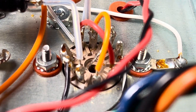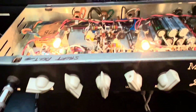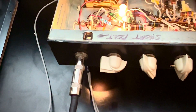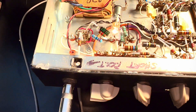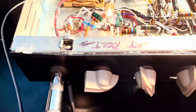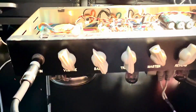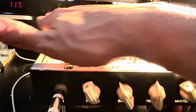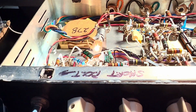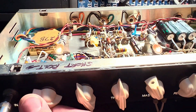And we're back — Steve-o, got it sorted out buddy. Turns out the little bit of ripple on the filter caps weren't the main instigator of the issue. What you're hearing now is master on 100 percent, channel volume on 100 percent — and the noise predominantly is from being in an unshielded chassis. Pretty quiet now — awesome.